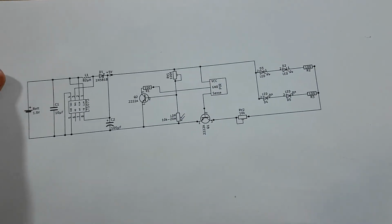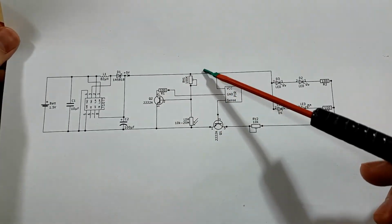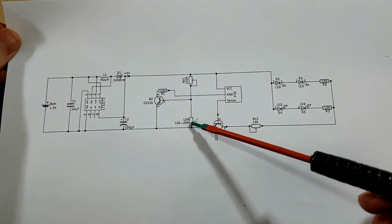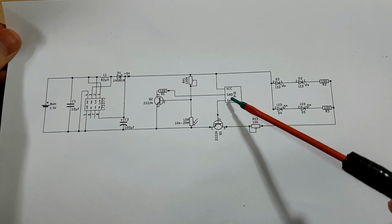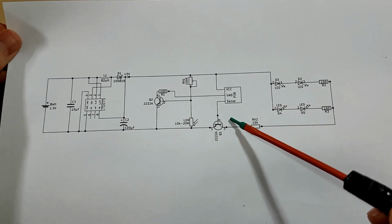And I do have the little schematic here that I did up. We're going to be removing this section here completely because the PIR module that I have actually has a connection for an LDR on it, which means that all of this is superfluous. I can just solder an LDR right onto the PIR sensor. And I have modified this slightly.